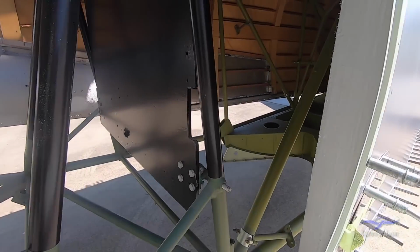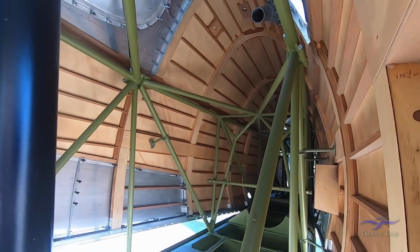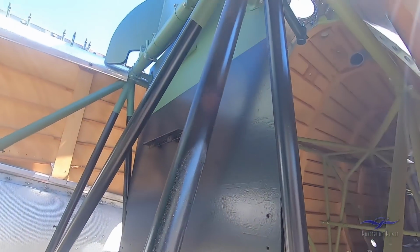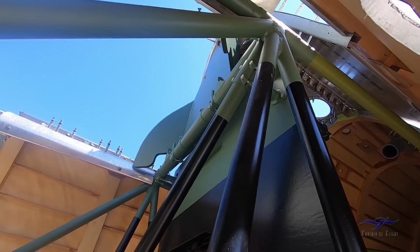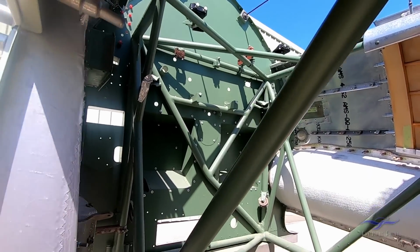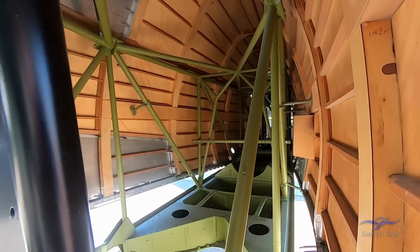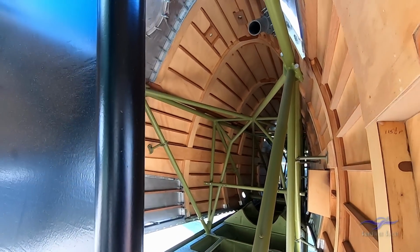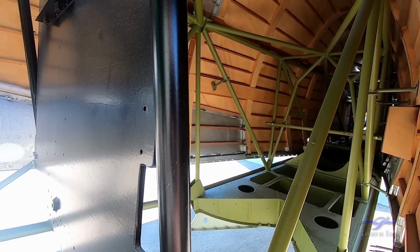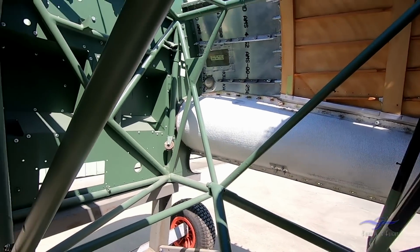If I just come inside a bit, you'll see down the back there how the whole timber shell covers the fuselage frame. We also have quite a thick steel armour plate here, which tracks right up to the head armour plate itself as well. And the reason why the fuselage hasn't been fitted out yet with any systems, any of the castings or fuel tanks, anything of that nature, is because we really wanted to get maximum access inside the airframe so that we can get this timber shell fully fitted out and drilled for all the different brackets.